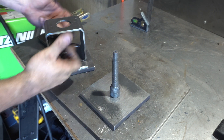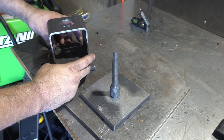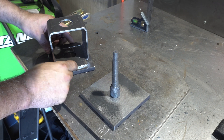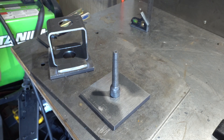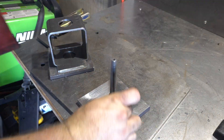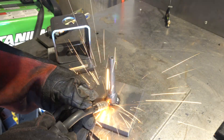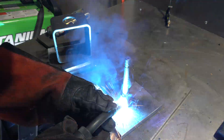The bottom piece — I've taken this piece of tube and cut a hole and a hole in the bottom, just so it recesses a bit. That's going to be my bottom so that when you put something in and lift up, it'll actually pull it off and it won't stick to the punch. I put these two here just so it's nice and level and I don't put marks on the edge of my material. All right, let's weld it up. I wanted to make sure I had a lot of weld around this — I know this is going to take a lot of pressure — so I put a bunch of beads around it and then weaved in the weld as best I could. I'm certainly no pro welder but I did what I could.